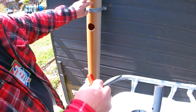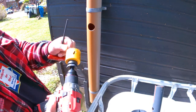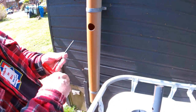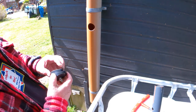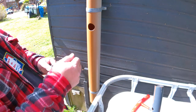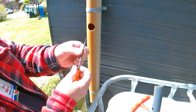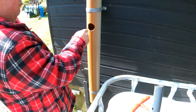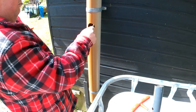You can use them on plastic — most properties are plastic now. The old cast iron ones — the hole saw will go through cast iron, I've done it so I know it works. But for a cast iron pipe, don't use the deburring tool because you'll end up breaking it. Instead, get yourself a small round file and basically just rub it around — inside and outside — until you've got it all nice and smooth.